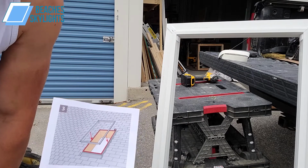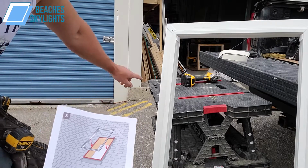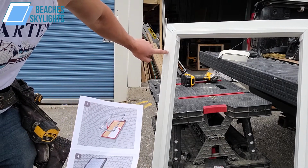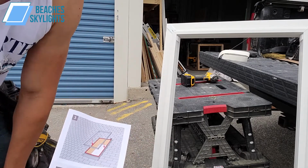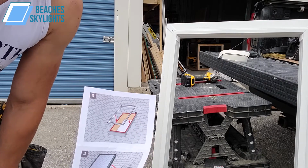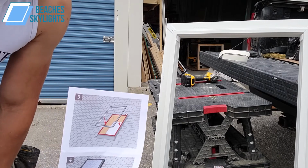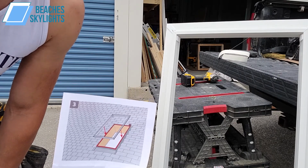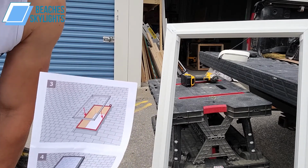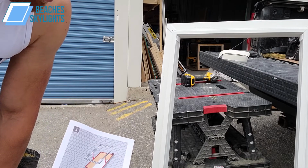That's why it's much more intelligent in this case, particularly, to pre-install the foam gasket with the sticky side up against the white vinyl here. That way it's permanently on there, it's not going anywhere, and it's installed properly. And in fact, that's the way that Velux would send it to folks who ask for a pre-installed tray, right? So, which is possible. Now, for those of you who don't know that, or in this situation that I am, where you ordered it and they did not pre-install it, you got to do it yourself.